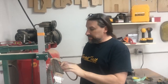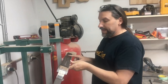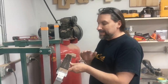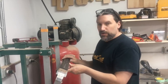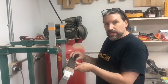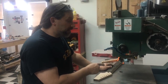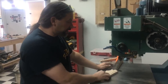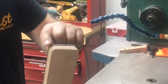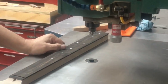Now we have a nice 10-inch radius on here. We burned through some of the inlay that was on the neck, so if you're planning on doing this and want to change the radius, you might want to ask the guys at Crimson not to put any dots in. We're going to go ahead and do our own inlay on this neck, so we're not too worried about it. The next thing we're going to do is cut it for binding. I've got my binding cutter in one of my pin routers and I've got it set, so now I'm just going to run the neck through the binding cutter. We'll clean up all of this stuff and put the binding slot — the little rabbet — in at the same time.